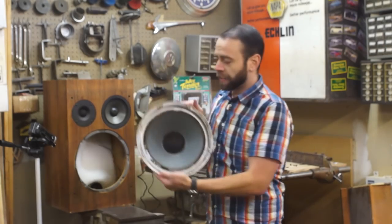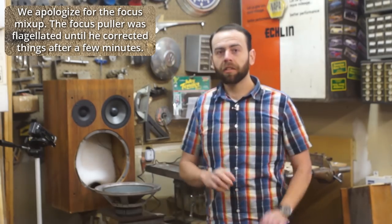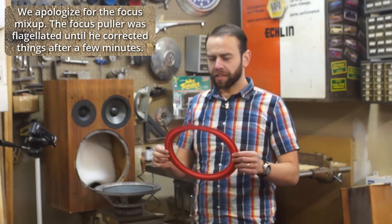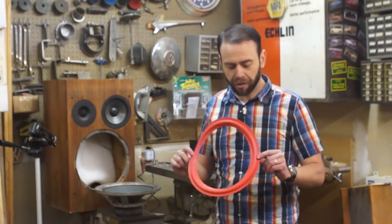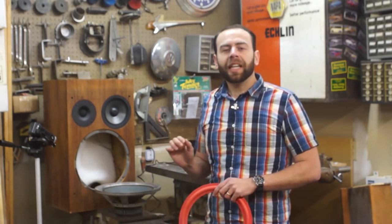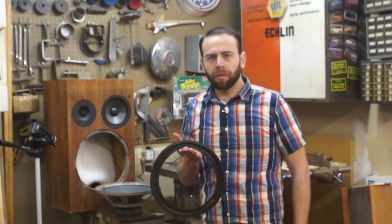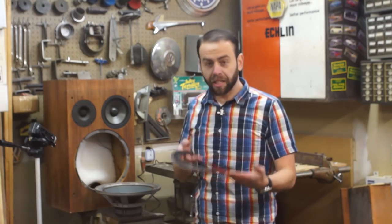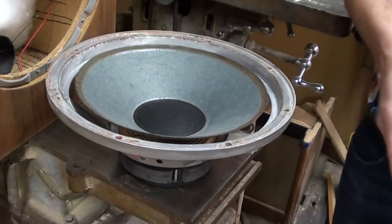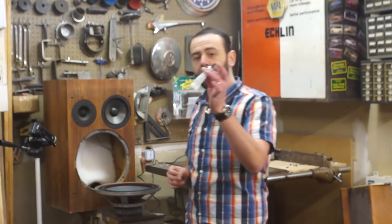Now we've got all the old gasket off — it's nice and clean, fresh, ready for the new gasket. Here I have the new gasket. This is a unique feature of the Cerwin Vega woofers: they put red surrounds on. The old one had kind of faded to a nice salmon. These are fairly inexpensive, about $20 or so for a set of two. It comes with glue and instructions. The instructions say to go ahead and put this upside down and get out your glue.